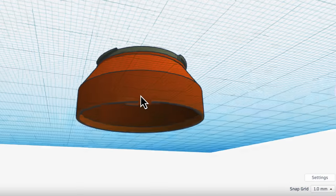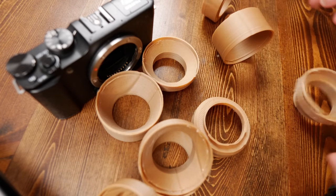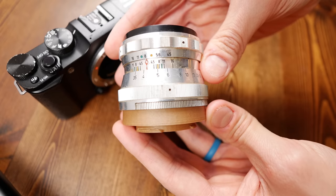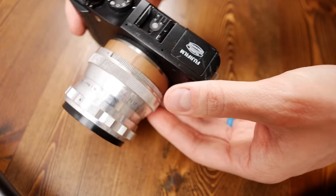After modifications, we now have a working lens that can focus and attach to the Fujifilm. I noticed it was only focusing to about a foot away and wouldn't focus any farther, which told me I needed to shorten the adapter to reduce the flange distance. So I went down about two millimeters each iteration, making notes each time. That took a long time and more prototypes than I'm willing to admit, but I eventually got the flange distance correct and have a working adapter that focuses to infinity. I also spent time optimizing the model so you can print it without supports — a really convenient thing.